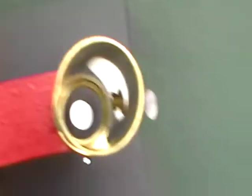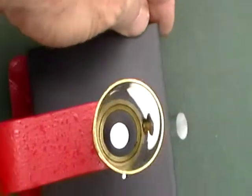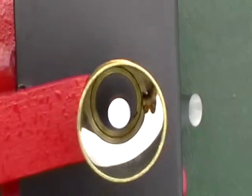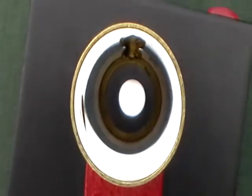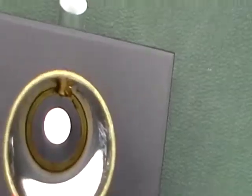Hold the stand for me. We can see now quite clearly the brass around the center. Let me show you what happens when I move it — you see we are throwing it off. You can see that's not properly aligned; we can also look at the microscope and see one foot sticking out more than the other. All you do is center it — look down the center of the tube, place the light in the center of what you see down below, and that's all. You also want to look at the feet out front and see if they are on there evenly. Basically you want to see that the feet look even, and it looks even in the tube.